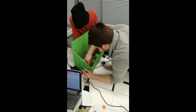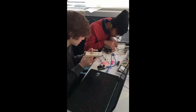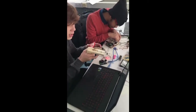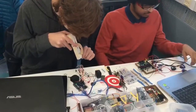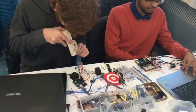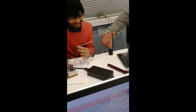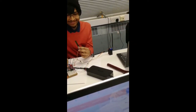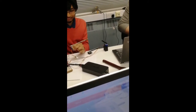Originally we worked on two separate Arduinos to handle different areas of the code — the servos and the sensors. Once we merged our code together into a single Arduino, we ran into a physical limitation. When the laser hit the surface of the photoresistor, the light and buzzer did not switch on until about two whole seconds after the shot was made.